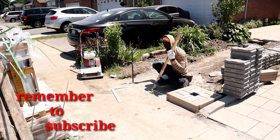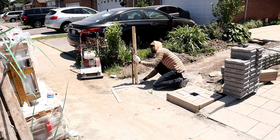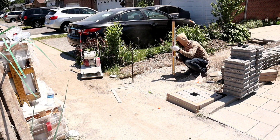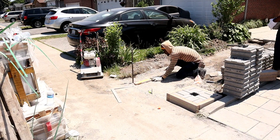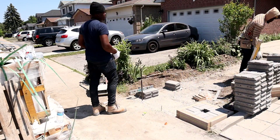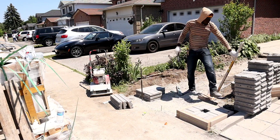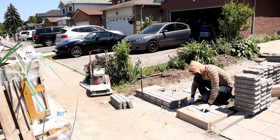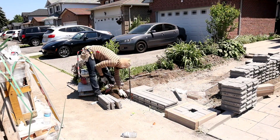This is the inside of our wall — we're gonna plumb from this line down to start our first block. I find it way easier to use mortar, or if you have some, polymeric sand works as well. I strongly recommend using sand or mortar for your first course — the way I was doing it before on the sub base takes so much time to get level. But once you get your first course, everything comes really smooth.